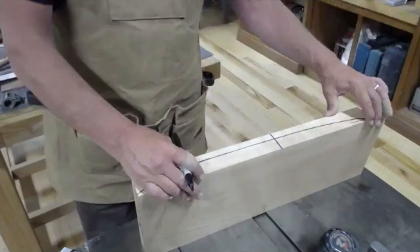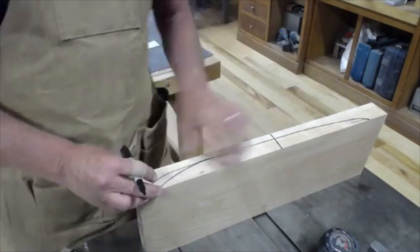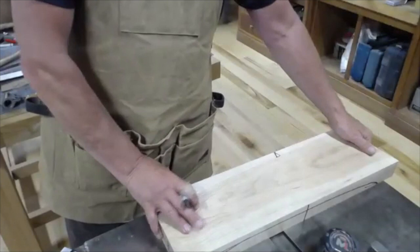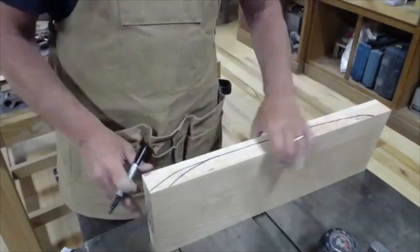And Hoadley, I don't know if you've seen his book, but he has a good discussion about that, the guy from UMass. Anyways, what I do is I put a clamp on the horizontal, this way and this way, until all my other clamps are seated, and then I pull those off and make sure that I'm still flush. As you know, when you put two surfaces together with glue, they kind of slide all over the place. So that's what I do to make sure that bottom side is flush.